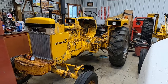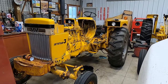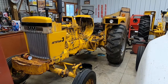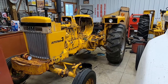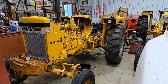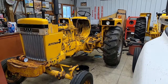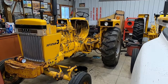Sorry about the extra noise — it's raining outside and I've got heaters going in the barn today, taking a little of the chill off. I'm working on splitting a 1969 Minneapolis Moline Jetstar 3 Super. I bought this tractor this summer from the original owner — actually his dad bought it new in October of 1969. When I got it, I noticed the clutch pedal didn't have a whole lot of play and the adjustment was kind of gone, and the PTO turned all the time. So I'm tackling some issues this winter so it's ready to go for spring.